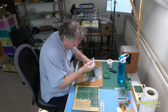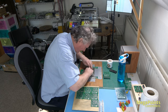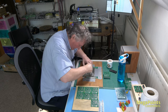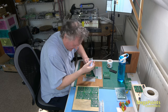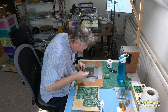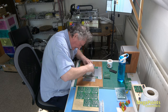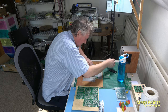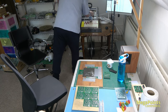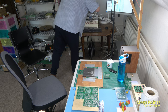Those two buffer chips it's just placed come from a tube feeder, which I periodically refill. So I'll figure out how to get the camera on the pick and place machine for a few runs and you can have a look at that. That's got to be a microcontroller, and there's the voltage regulator. Yep. There's the next board. Stick it up to the magnifying glass. That looks lovely, that.